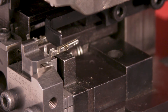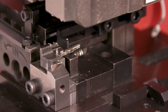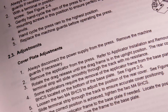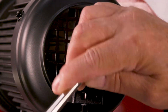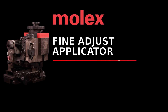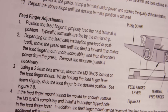The terminal strip should move with some resistance, but not so much that the strip bends when pushing by hand, and so that any forward or back axis movement is not transmitted from the left side of the applicator to the right. See Section 2.3 in the Fine Adjust Manual for adjustments or to determine if the track is binding on the feed finger. Rotate the drag release to engage the terminal drag frame and cycle the press by hand so that the feed finger transfers the next terminal to a centered position over the anvil. If the feed finger does not properly engage and advance the strip, or does not move back properly to engage the previous hole, you may need to make feed finger and backstroke adjustments, found in Section 2.1 of your manual.